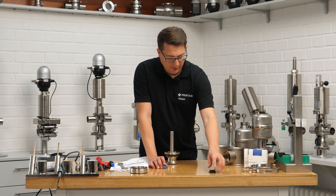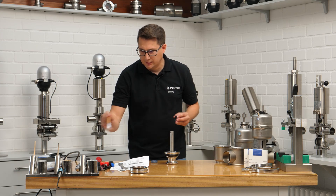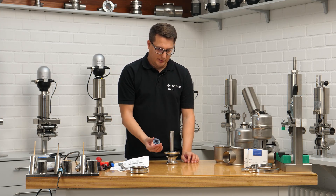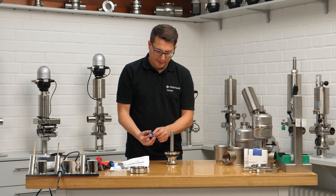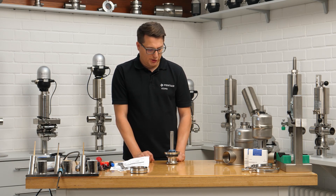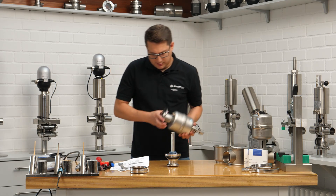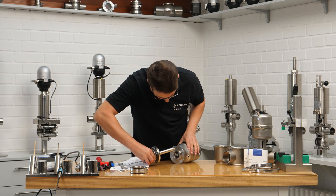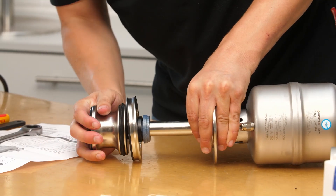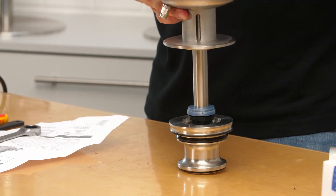When we have the disc in our hand, we can already bring everything back in the right order: the cap, then the seal. A little bit of lubricant on the side is recommended. Push that down. There's a right way to do it — there's a little shoulder here which has to go behind the seal. Push that down, and then put that now back into the actuator. We have the fast coupling — slide that in here and then up.